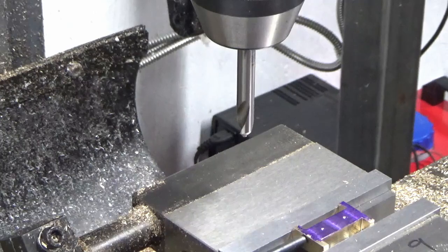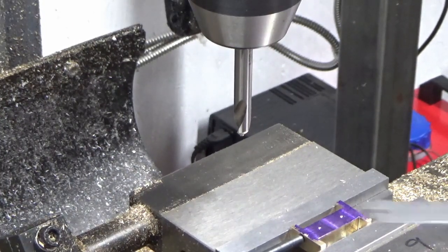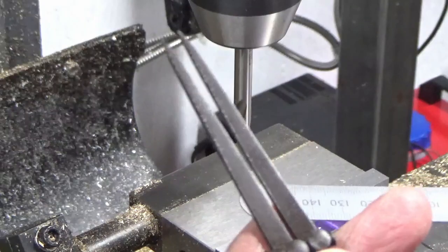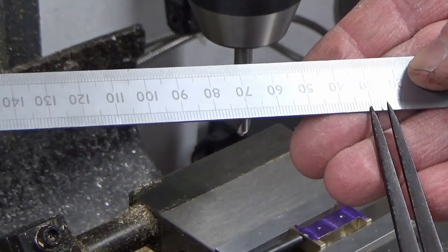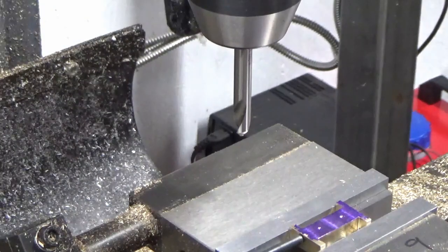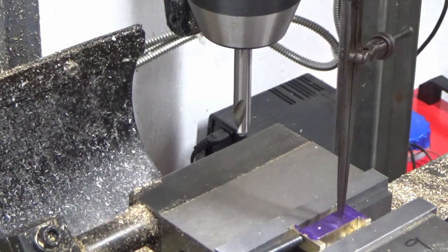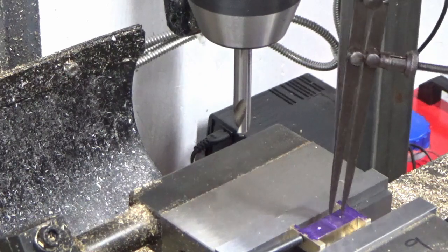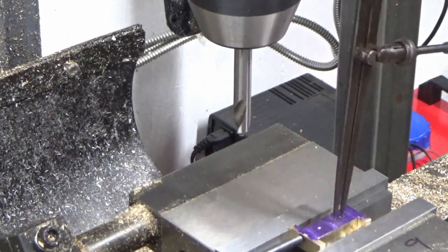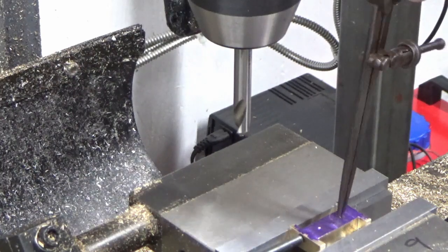As if by magic we're back. So we're now going to use some incredibly high-tech technology, and we've got a pair of dividers, and we've set those to the radius that we want, and we're just simply going to drop that into that little centre dot we've put in and mark into the blue our radius.